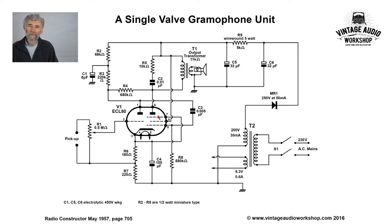There's not a lot to say about this — it's a bit more complex than it could be for a basic amplifier. There is something that when I first looked at the circuit I thought, what's that about? Look at where the earth return goes for the pickup — you'd expect it to go to the chassis, but it doesn't. It goes to 220 ohms in the joint cathodes, with 180 above it, and it's decoupled by the 100 microfarad capacitor. The reason for that is that the pentode section requires more bias than the input triode, so they've tapped it off at the appropriate level, applying a positive voltage with respect to earth to the control grid, but still negative with respect to the cathode by the right amount.